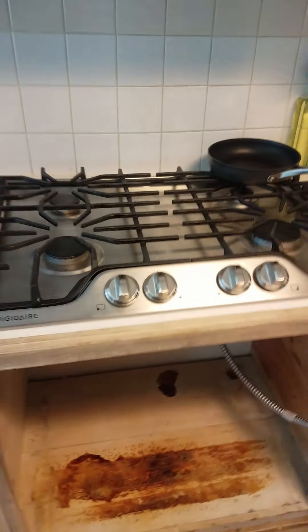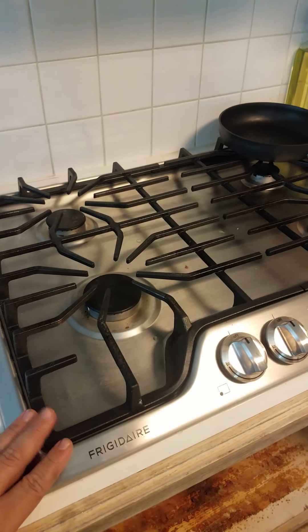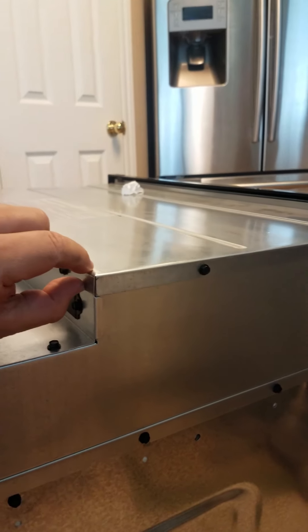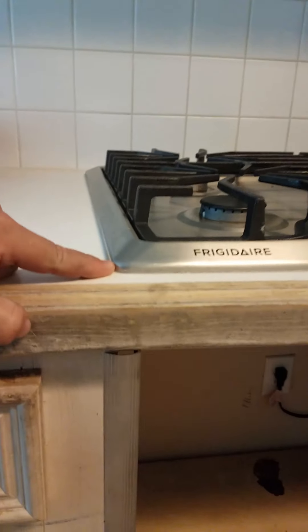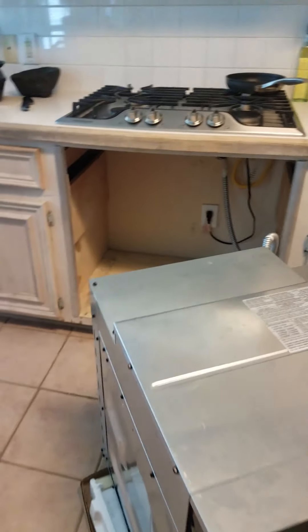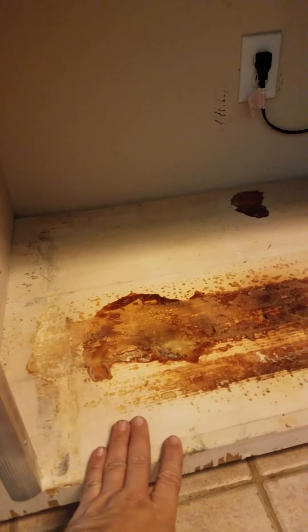The oven is a little too tall on the inside — it hits our stove top. We upgraded our cooktop a couple months back, and the cooktop comes down a certain amount. This spot right here is interfering with this spot on the oven — it's maybe half an inch too tall. There are two ways to go about this: either lift the cooktop up half an inch to an inch, which I don't want and it'll look horrendous, or we can cut this out and lower the whole level down about an inch.